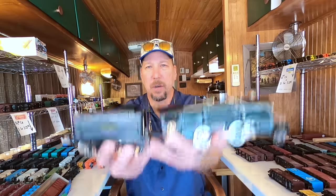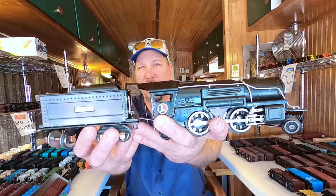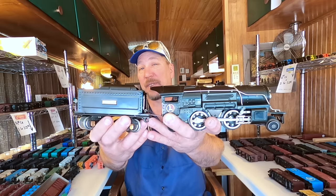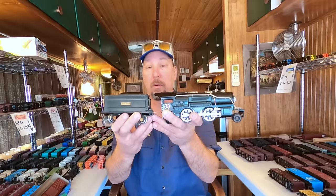We're also going to work on this beautiful pre-war 259E. This one came from Mike Goldner down in the Indiana area. This is the second time it's been here - we've been fighting with it, and I decided the diagnosis is that we need to rewind the motor and build a new commutator. I'm going to intermingle these two completely unrelated stories in one episode - it'll remind you of pretty much anything Quentin Tarantino's put together.